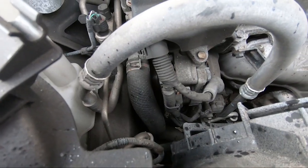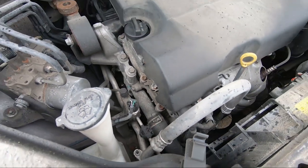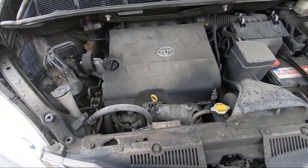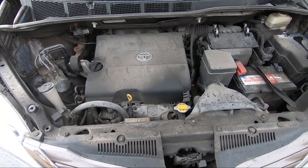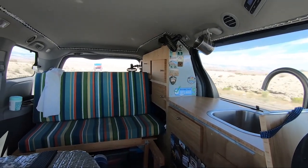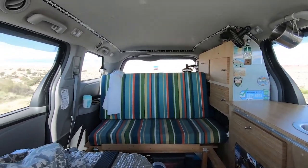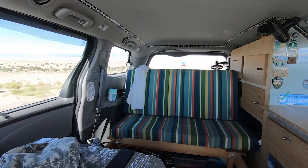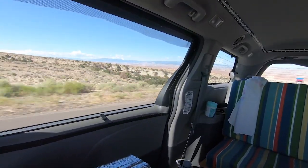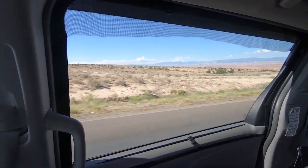The alternator is what charges the battery of a vehicle. I opted not to charge my auxiliary battery with the help of the alternator, not just for the possible impact on the warranty, but mainly because it would have required a lot of driving hours per day to charge that auxiliary battery. An alternator has a capacity which is designed to meet the charging needs of the vehicle, not to charge another battery that will supply a fridge and other electric camper devices.